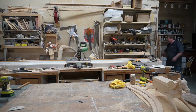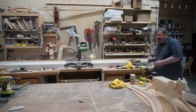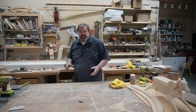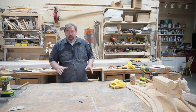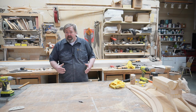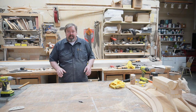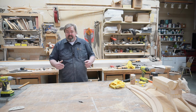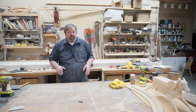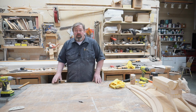Well, that is just one more big item off the list now of things to do. So I'll let that sit in the paint booth, let that glue set up for a little while. Then later on today, this afternoon, or kind of before I quit for the day, I want to give that a good sand, and I'd like to get stain put on that. Then possibly we can get in here tomorrow and set the spray gun up and put our first coat of clear on that.